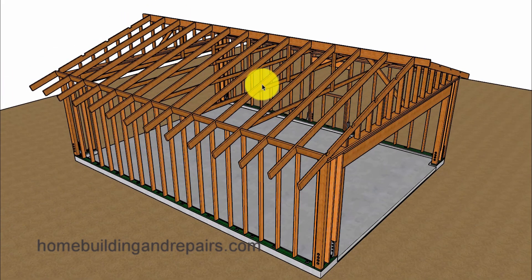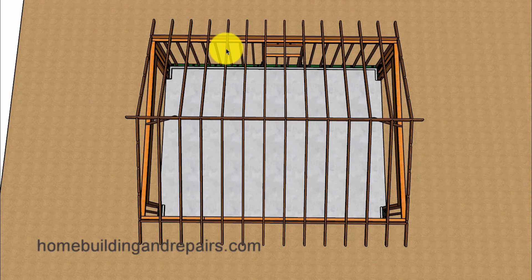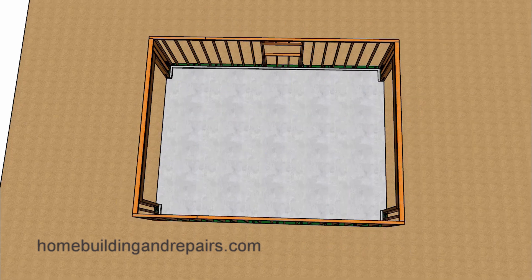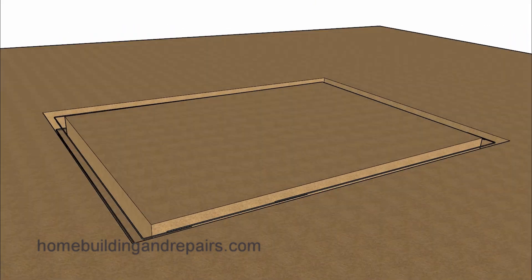We have 2x6 rafters 24 inches on center and 2x4 walls on the outside, with 2x6 on these sides to provide a little more strength. For those of you who are not familiar with my channel, this is not meant to provide structural engineering information. You might need to contact a structural engineer in your area or local building authorities before building something like this.